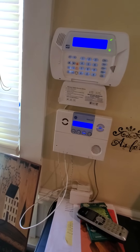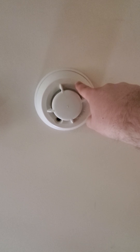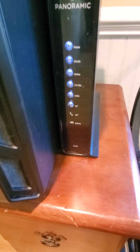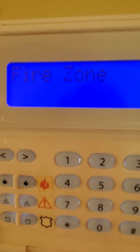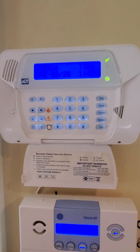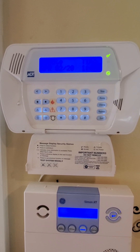Let's go ahead and do the smoke detector next. Here's our DSC wireless photoelectric. Obviously this is an instant dial — fire alarm. That should be zone 13, living room smoke. Let that finish resetting. You'll hear it click when it's done dialing.